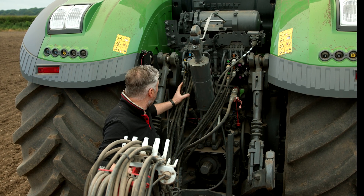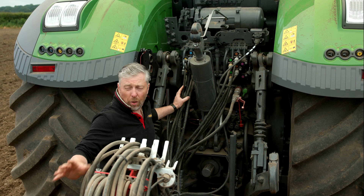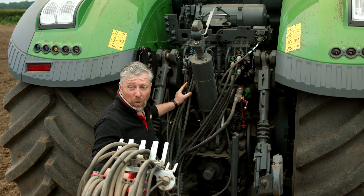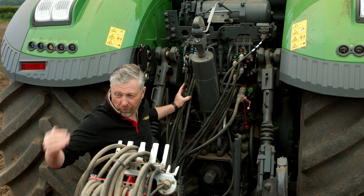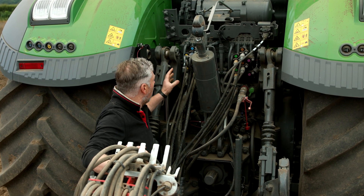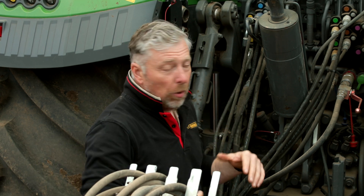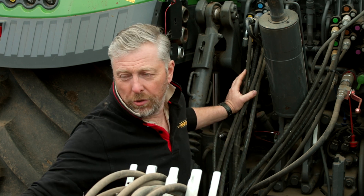On this tractor we also have the ability with the top-down e-Service to use the top-down in a classic way. If we had a problem with the tractor, we can still use it normally on the tractor spools — in this case we need four sub-spools for the four zones. That gives us the opportunity to use the LS to its optimum, but we can also put a replacement tractor on it that doesn't have LS hydraulics and still go top-down.